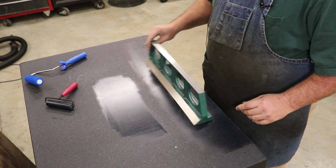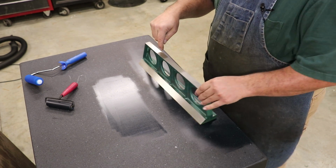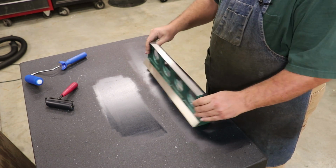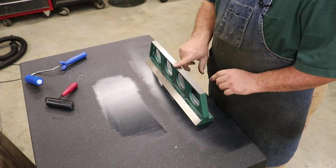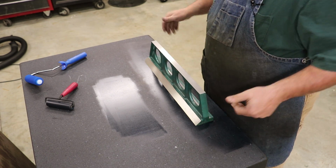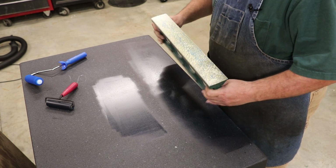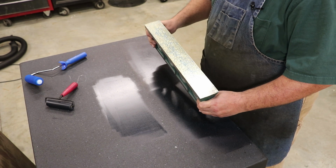And again, as always, we're going to hinge it, and it's going about here and about here, which is about 30%, which is just what you want to see. That's telling me that it's not high in the middle, it's not high on the ends, it's fairly flat. So let's pull it off now. And yeah, we actually increased our coverage there a good bit.